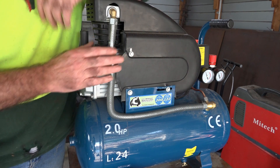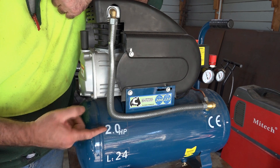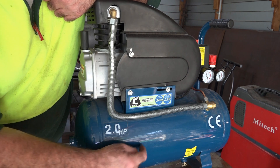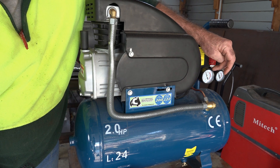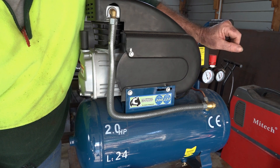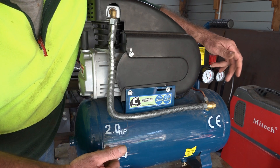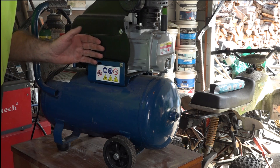Let's have a look at the direct drive one first. All pretty simple really — this is two horsepower, it says two horsepower, I've got my doubts, but that's what it says on the tin. It's 24 liters, so that means this can hold 24 liters of air in the tank under pressure, and the pressure can be anything from about 100 to 120 PSI — I think it's set at about 110. But you won't get 110 PSI for the whole 24 liters; once the tank is filled up the air will start to bleed out, that's why you have a regulator.